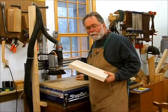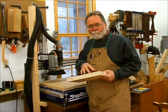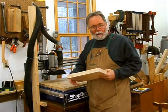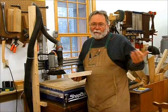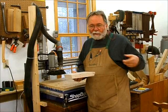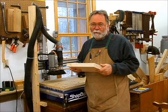First I'll cut the male pieces in the maple, because they're cut with no extra clearance. And so I've got 5 of these blanks. I'll cut all 5. And then on my first blank in the cherry, which has a 7 thousandths clearance, I can do a test fit and make sure that clearance is still right.